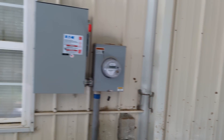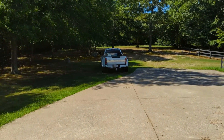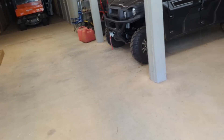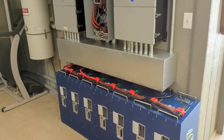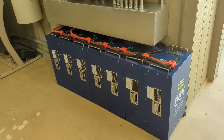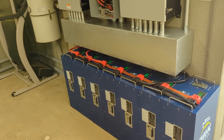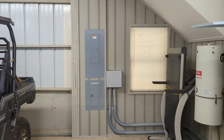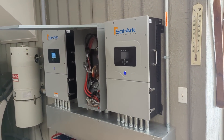We're keeping the place on the internet, air conditioning, HVAC working. Elijah and I are just cleaning up today — extra panel pallet, battery boxes, junk. A lot of people ask: can I scale? Yes, you absolutely can. You can scale the batteries, the inverters, and the solar. The systems today are very flexible for that, which I really appreciate and so do the homeowners — nobody ever asks for less power, they always want more. They could sub-feed to other buildings from either one of these panels. With 75 amps continuous output, they can do a lot.